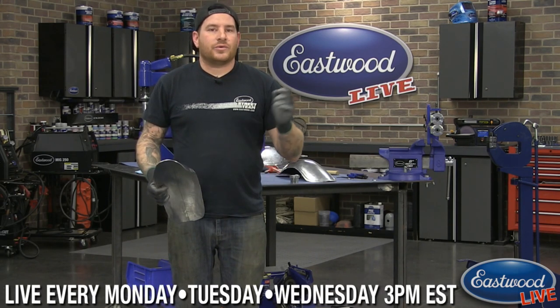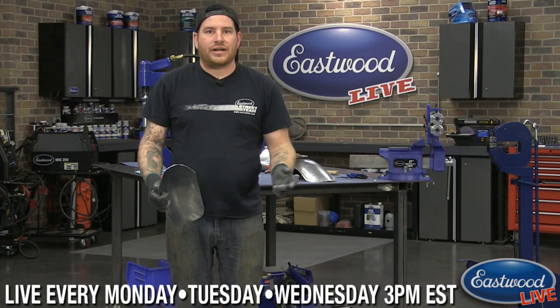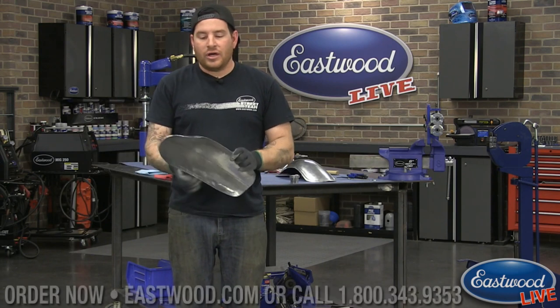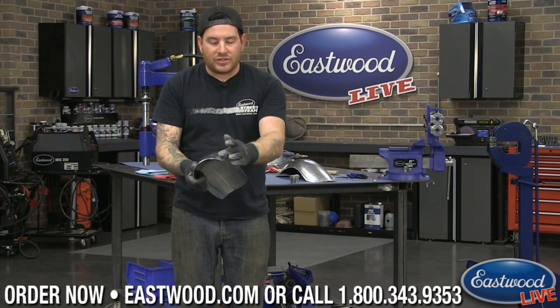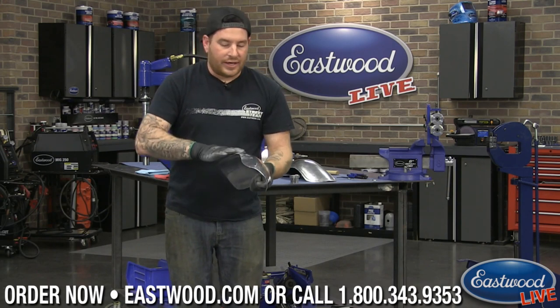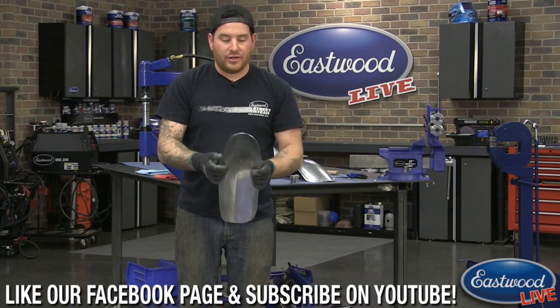Really the only thing that matters is you want to match your die as close as you can with the radius of the die to what you're actually working on. Same with the English wheel. With a sharp die like that, I'm able to get in these corners here, working away and making this line kind of here from where we were shrinking. But yeah, it's a good one.